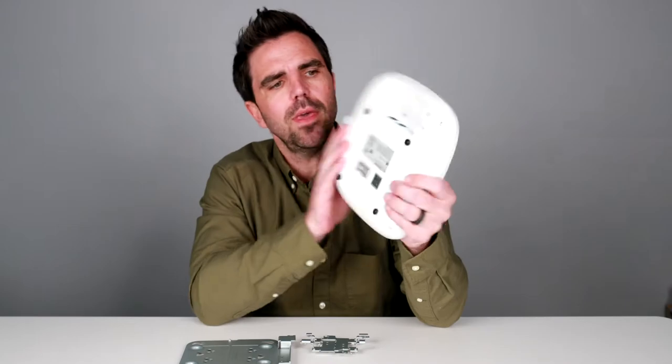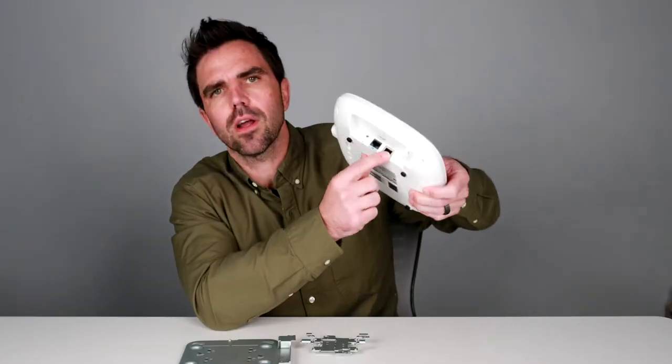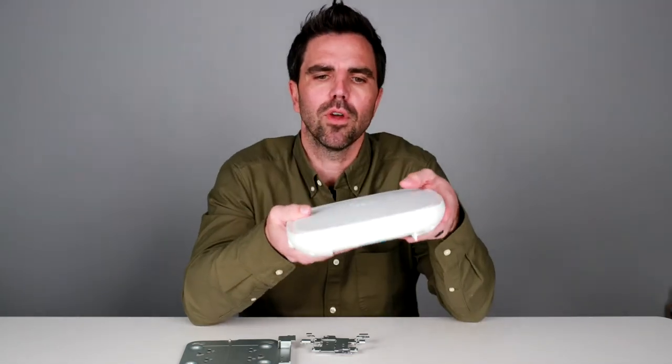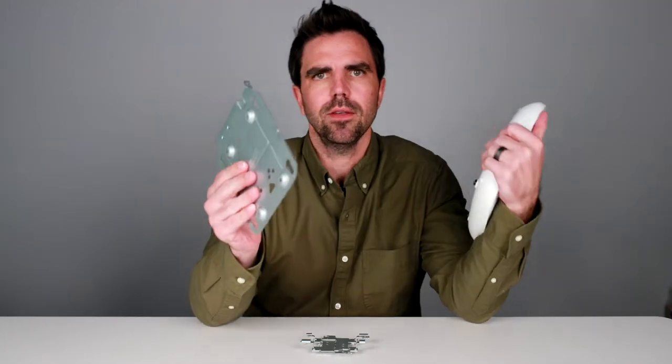As I pick up the AP, you'll notice that the four posts are right here. And on the top here, you've got a console and an ethernet port. You'll plug in the ethernet connection into the AP, and it will get power over ethernet to turn on the AP. Then you would mount this to whatever surface you're going to be mounting it to, whether it's a wall, a ceiling, that type of thing.